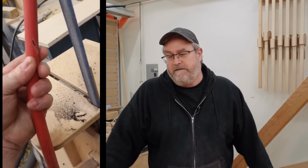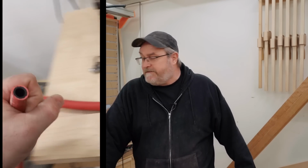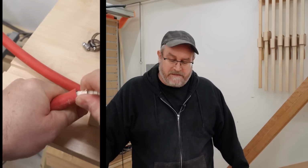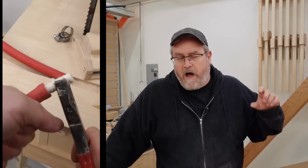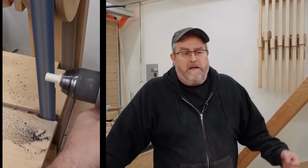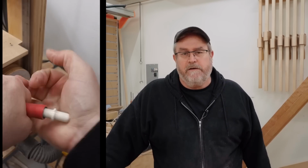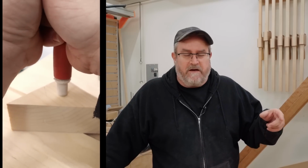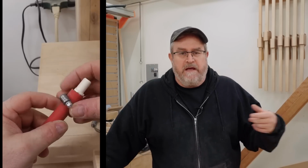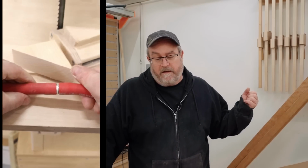What happened was I sanded through the hose, and then I needed to fix that so that I can have air out here in my shop. I didn't have the proper stuff you can get at a hardware store. I had a PEX coupling that would almost go in there. I tried to get it in there, but it wouldn't go. So I sanded down the ridges that are on there, and then it did go. It was a nice snug fit though. I got a couple of hose clamps on there, and that buttoned it up. The hose clamps have that extra bit sticking out, and I thought that maybe that could be a problem, so I ran some tape around that, and that made it so that they're no longer sticking out, and that fixed that.